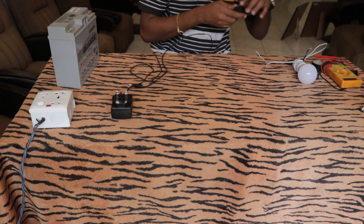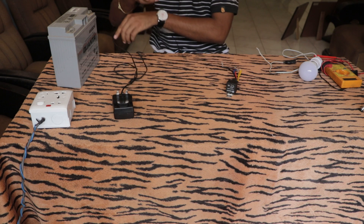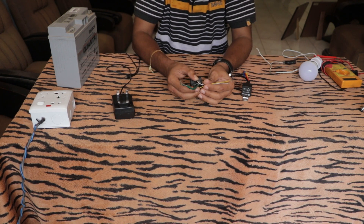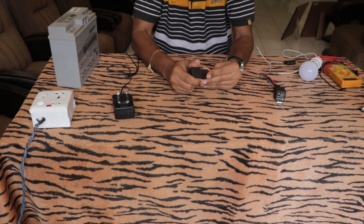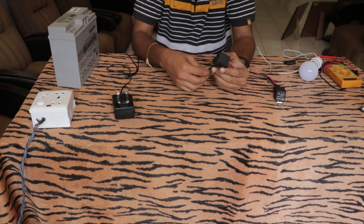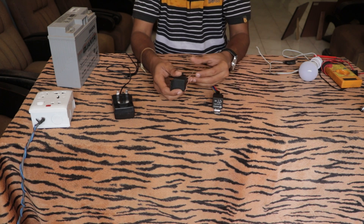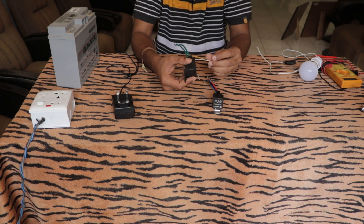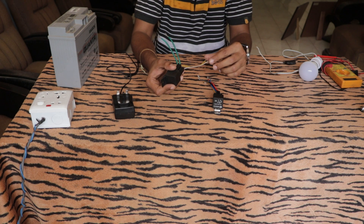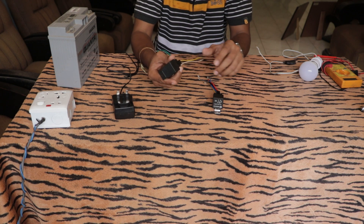The brain of this project is the relay. There are two types: the four-pin relay has four wires and is more useful for wiring horns, headlights, and off-road lights in your vehicle. As long as you give power to two wires, the other two wires will be connected. As soon as the relay loses power, the switch also turns off. We are not going to use this type.